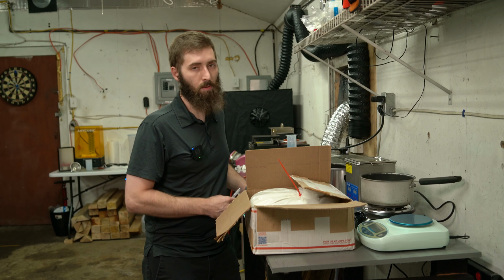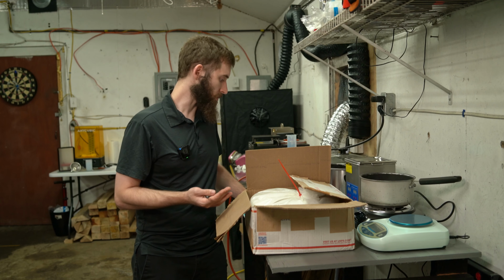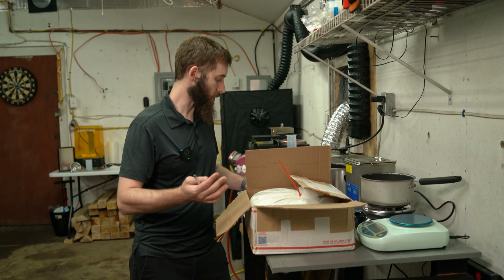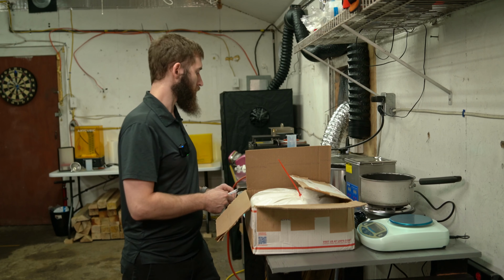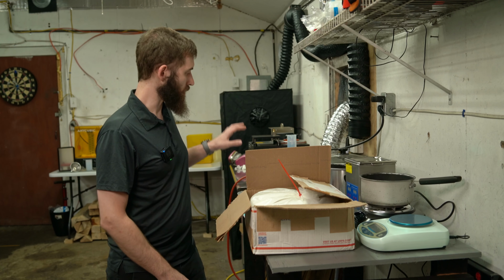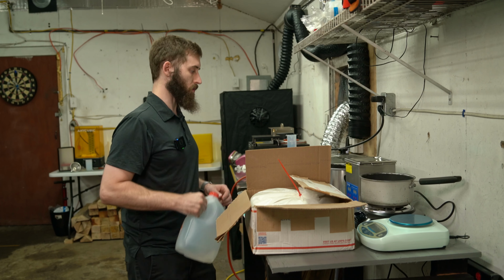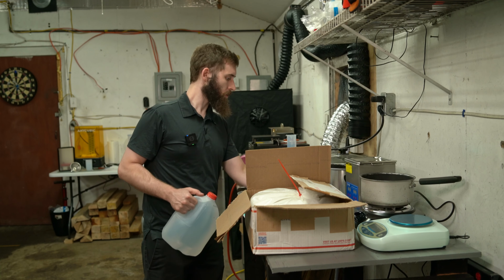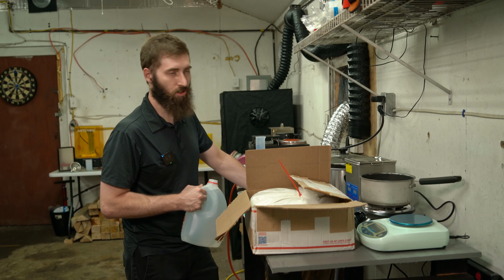And then in order to get how much water you need, you take the volume, which is 463 cubic centimeters, and then multiply that by 0.494 milliliters, which gives me 228.7 milliliters. So I'm going to measure all this out, weigh my powder, get the water measured up, and I'm using distilled water at outdoor temperature, room temperature, but 228.7, so we'll get it 229-ish milliliters.